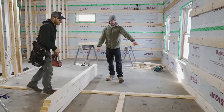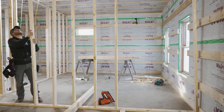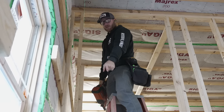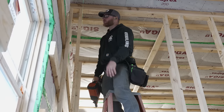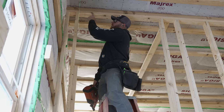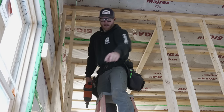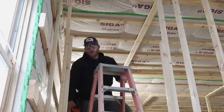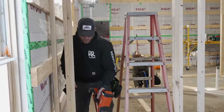Now I know some people are going to say: if that laser is not perfectly perpendicular to this door jam wall, how are you using it to plumb things up? That only makes a difference if the wall you're trying to plumb something into is also not plumb. But since we made sure the tops and bottom plates were installed at the same time with the same laser — perfectly plumb to each other — I could actually move that laser in an arc around this point and in theory this is going to be perfect. The laser being square to the wall just doesn't matter at this distance when you're installing on a straight, plumb, and level wall.